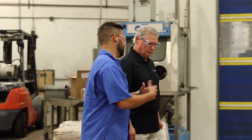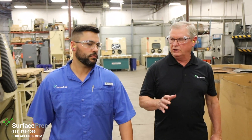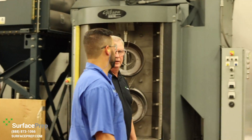So what do you think about 20 minutes on those parts — do you think that's long enough? Yeah, I think that'd be our first check to really see how well the process is doing. Because a lot of times customers will run parts longer than need be, and that just wastes water and compound and reduces the throughput you can get from your machine on a daily basis.